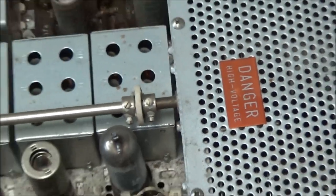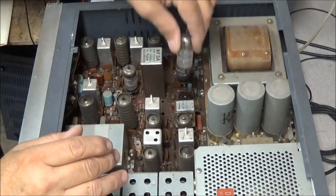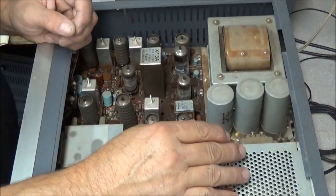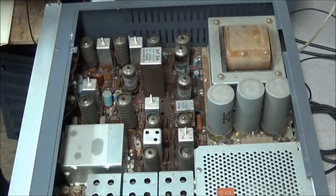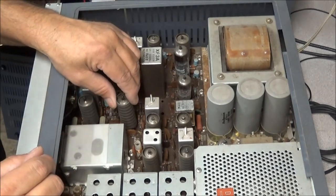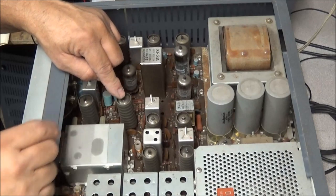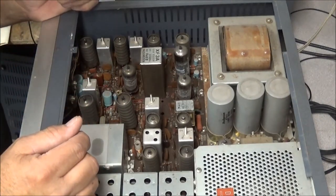A lot of times when you get a radio that does nothing, you can go in, pull tubes, and reseat them. You want to pull the relays and clean the contacts. There are two relays — one in the back for the antenna relay and one that runs various functions for the external VFO and other things. When pulling these metal shields out, be careful — you're not just going to grab it and pull the whole tube out. There is a strip of wire that runs up inside between the tube and the shield, so be very careful not to snatch that strip out — it's easy to break.